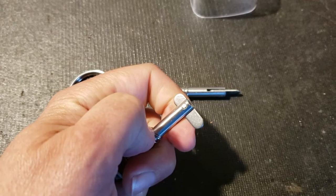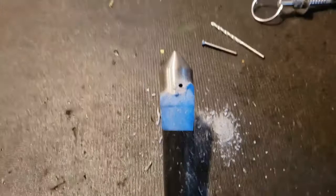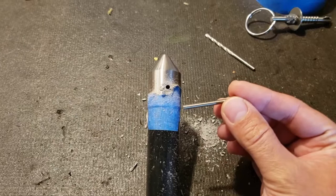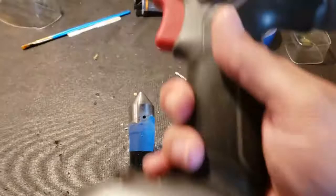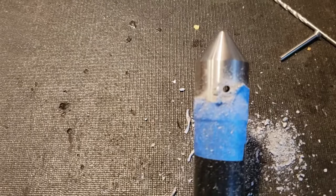To secure the stainless steel tip a little bit better, as you can see, I drilled an eighth-of-an-inch hole through that. What I'm going to do is essentially pin it with this machine screw right here — this is stainless steel. I just used a cordless drill to get through it. The biggest thing I did was tape around the end on the stainless steel tip to make sure it stayed stable. And as you can see, that's a nice clean hole even with a relatively low-power drill.